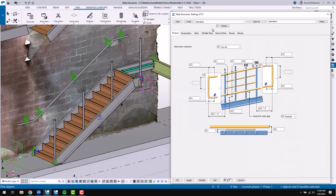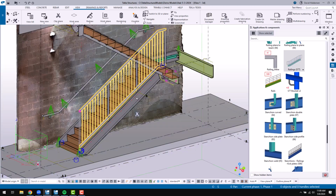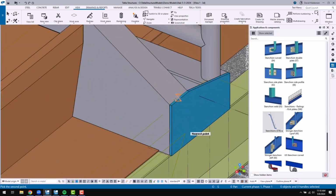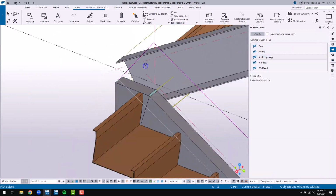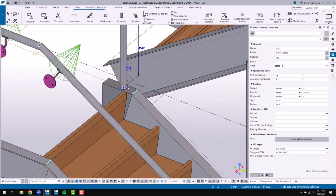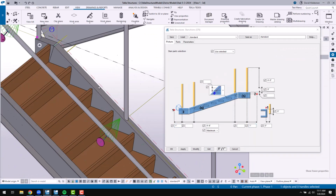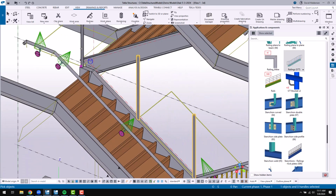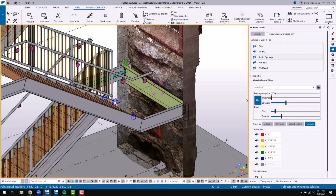So switching from S76 to S77, loading a picket rail preset. You'll notice in that drop-down, there was a lot of different presets to start with. And then I can pull out that clip plane a little bit to see the next stringer in line and go ahead and repeat the same thing, just putting in some posts, some stanchions there, turning on the picket rail as well to apply that to these. And this is just the sort of thing that you would start to work your way up one floor at a time from bottom to top.